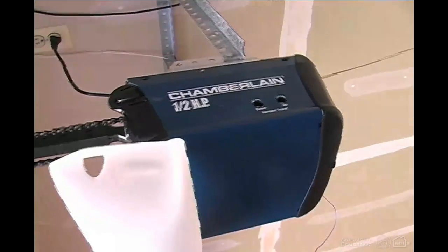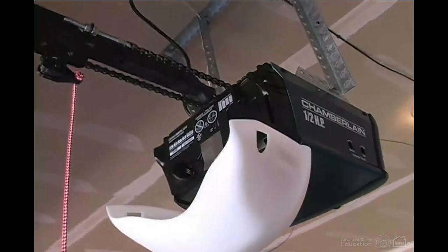Adjusting the garage door springs will weaken them. So unless the door is seriously out of balance, you might not want to recommend adjusting them. Modern springs have about a 4-year lifespan as opposed to a 20-year lifespan on older springs. Garage door openers themselves have about a 12-year lifespan. So if it's an older opener and it's not working correctly, you might want to mention that fact in your report so that people don't spend a lot of money having it repaired as opposed to just replacing it.